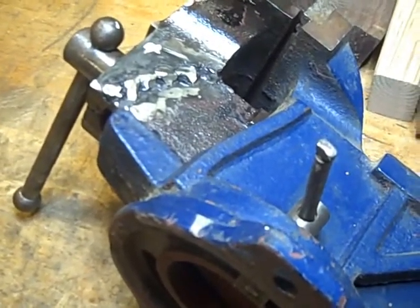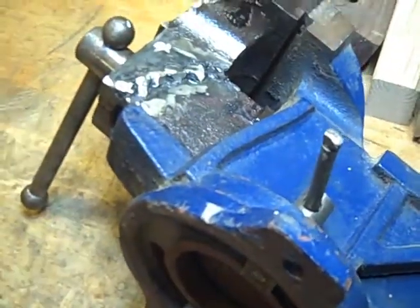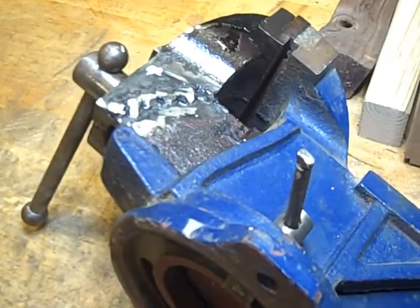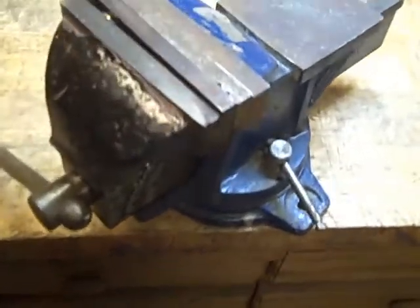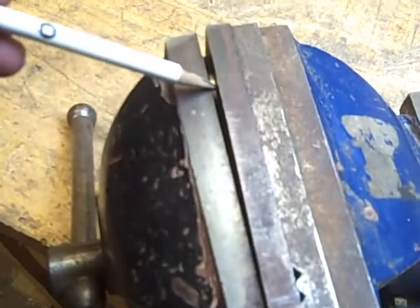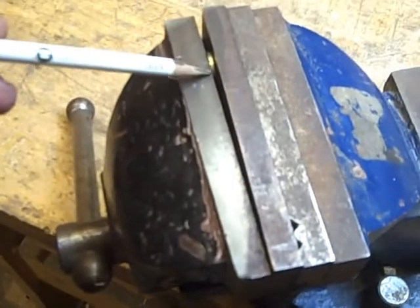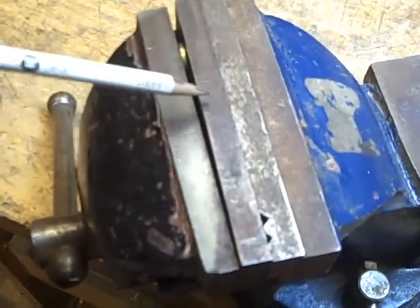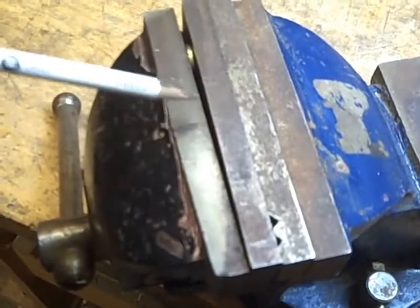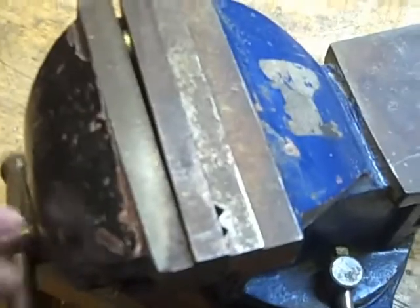What I had done was to clean it off and thought I could give it a shot fixing it up. Another challenge with this vise was the misalignment of the jaws. You can see the spacer I had to put in right here for the two screws that hold the jaws, so that the stable jaw and the movable one would be parallel.